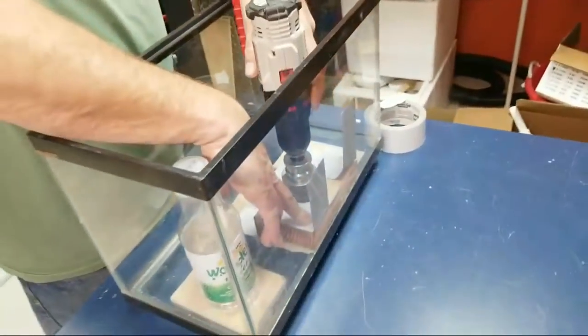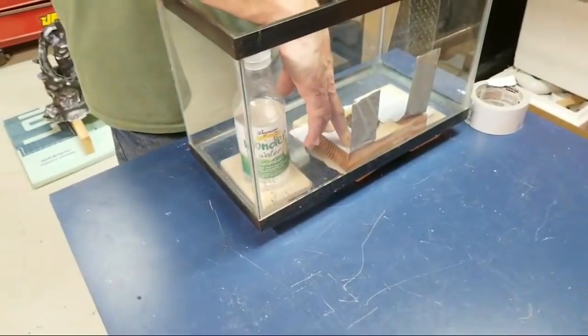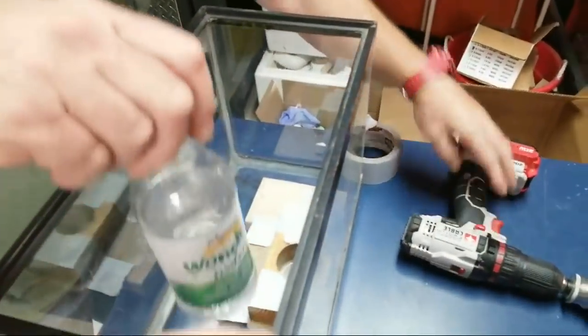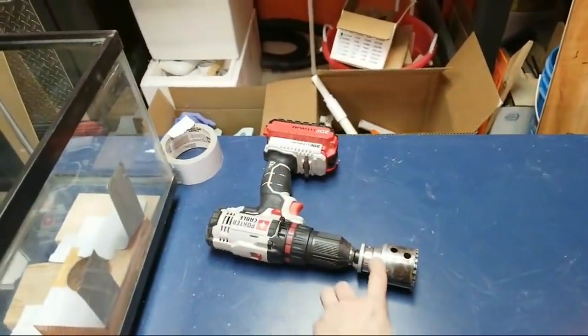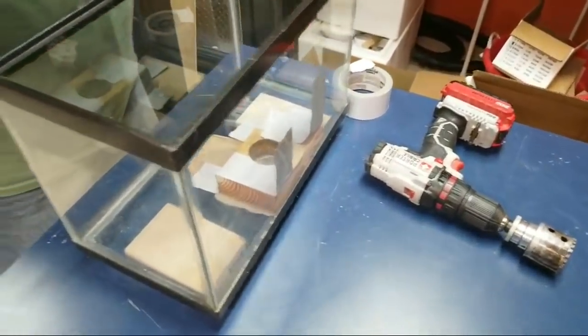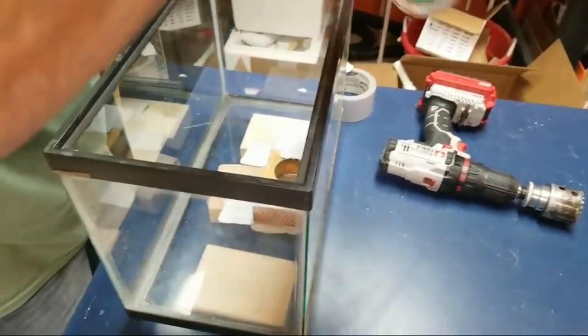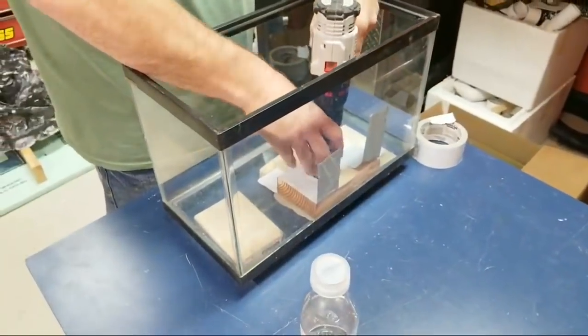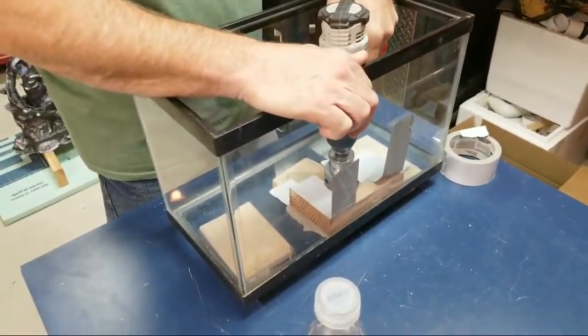It's going to feel like it popped — this is really thin glass, just watch it, don't drop it. The diamond blade when you stop — the centrifugal force from the weight throws the chuck loose and it falls out almost every time. Got a little more water in there. Wasn't sure if it got dry. Tighten that chuck. He's going to keep going — always check and make sure it's wet.